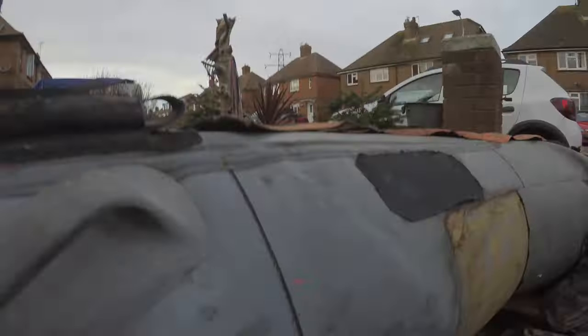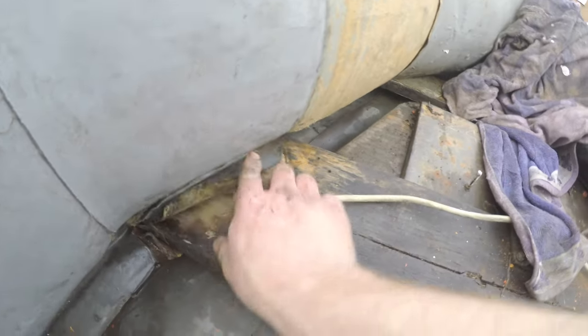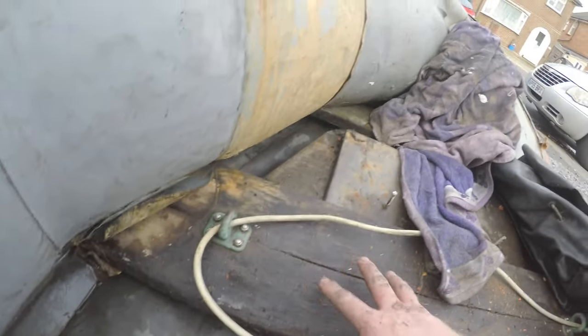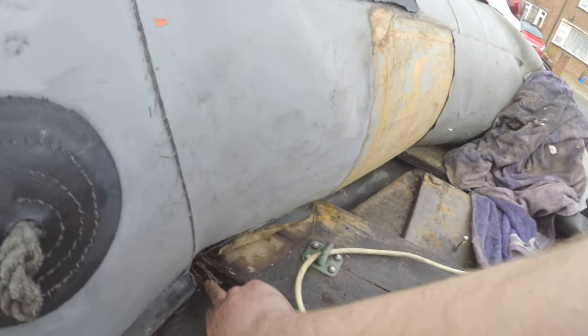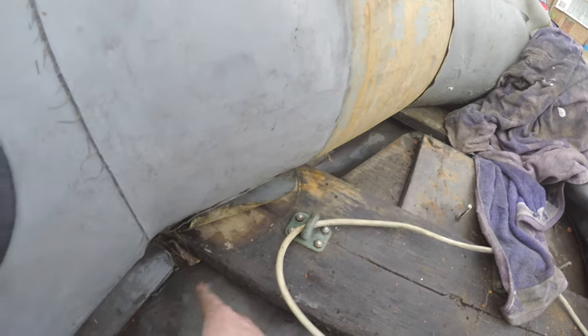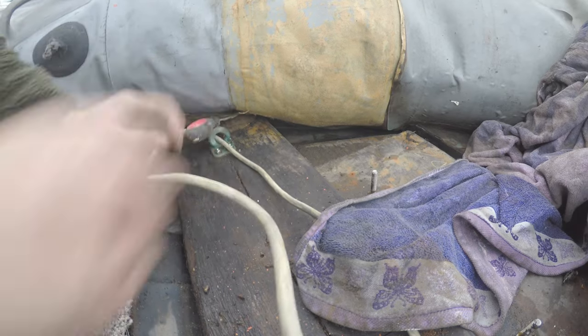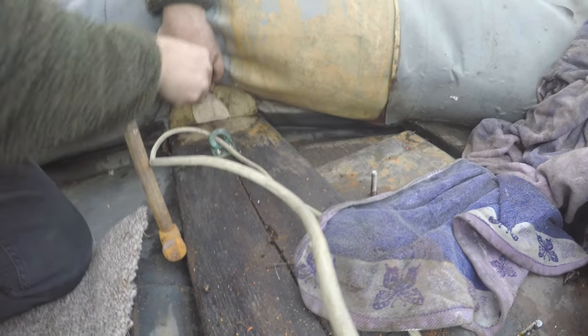By pushing pressure on the wood and pulling it back, it actually slows the leak down — you can hear it, and now you can't hear it as much. The wood has obviously gone inside. I've started to peel back this bit of fabric attached to the wood. I'm going to try and remove this whole wooden console so I can look at the boat in full detail, properly wash it, and then fix that leak — with the wood in the way there's no way of guaranteeing I can seal it without it leaking again. Using a scraper, just gently easing it off the boat. The bit of wood is out and now I can properly investigate — pump it up and we'll have another listen.